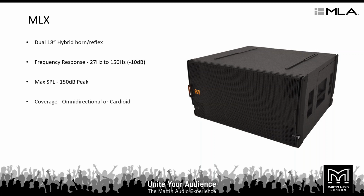Frequency response all the way down to 27 Hertz minus 10 dB is actually plus minus 3 dB, sorry. We can get down to 35 Hertz. Maximum SPL is 150 dB, so this is really a very, very powerful double 18 with a weight of 160 kilos. So if you want to stack them, you might want to ask a friend.